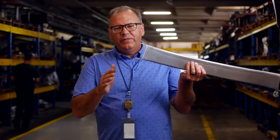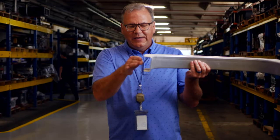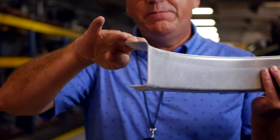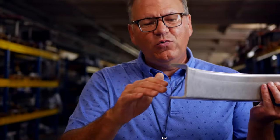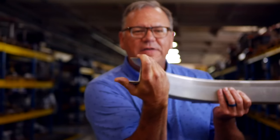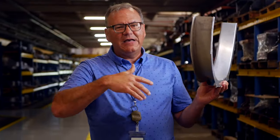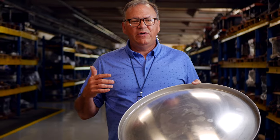With hydroforming, we would do an initial form where this goes straight up, this comes out — this is the flange. But then the hydroform can, with pressure, form this back at a negative angle. You can't do that with stamping. So with the same tool, we can form this up and then wrap this around so you're getting that negative angle. Stamping would probably have to form the part straight up and down, requiring a pretty massive tool. This is another interesting advantage of hydroforming.